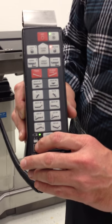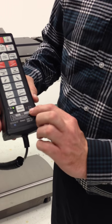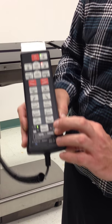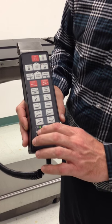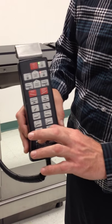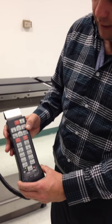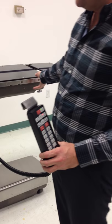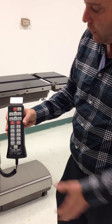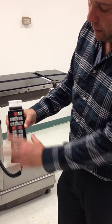That green light tells us that the table is recognizing it has line power and is charging the batteries. This light here blinking red means the batteries are low. We just refurbished this table — it just came into the showroom and the batteries haven't been charged yet. You want to make sure the line power is green when plugged into the wall; that tells you the circuitry is working correctly for the battery charger and that they are charging. Now the unlock button is blinking, so we need to lock this table in place. We press floor lock and then press the lock button. You hear the motor actuating, the feet are coming down, and it's locked — you know it's locked because the green light comes on the lock button.